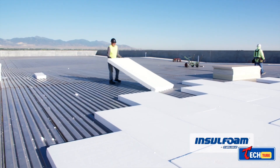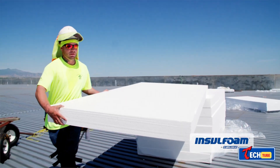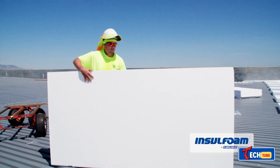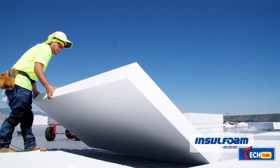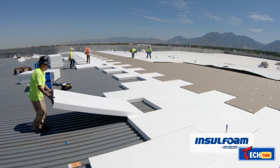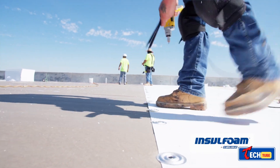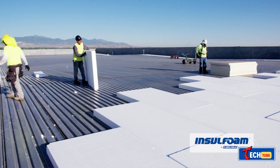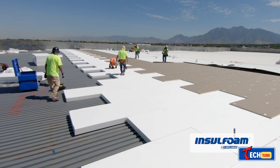InSoul Foam hybrid roof system: in Sandy City, Utah, a property developer chose a hybrid roofing system comprising polystyrene and elements of polyisocyanurate for warehouses and office buildings. This material is rigid, repels water, and withstands chemical and mechanical stress. It's cost-effective, simplifies installation, and is quicker compared to similar options — ideal for the area's heavy rain and wind in winters.